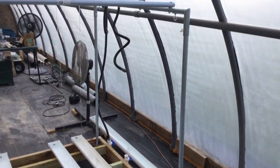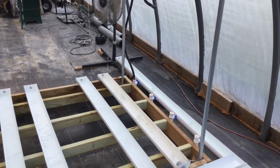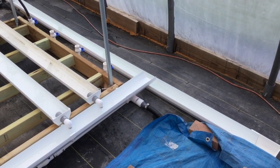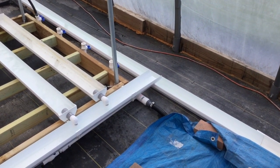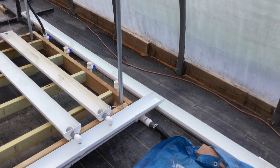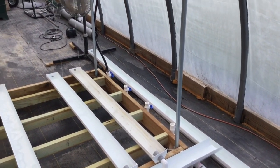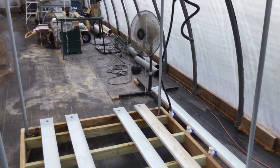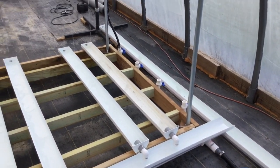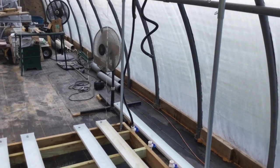The main thing I want is pressure, so that's why I use a larger diameter pipe down there at the bottom — a one-and-a-quarter-inch ID PVC line, or 32 millimeter. That can keep going, but I keep the pressure in the bottom. All I want going up is volume — I don't need pressure up there, I just need volume.